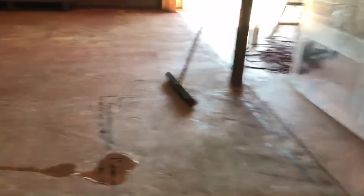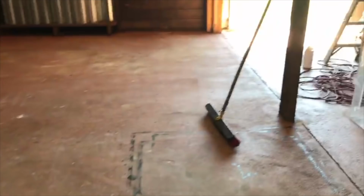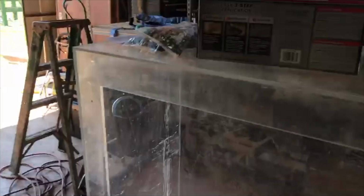So first off, I gotta scrub the floor and everything, prepare it to put the paint down. I got it from a Home Depot, a three-step easy thing. The first step is prepare the surface, that's right here. I gotta put this crystal stuff down into the bucket, fill it with water, stir it for a couple minutes, and spread it all around this floor area.